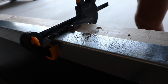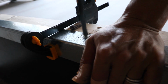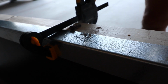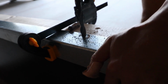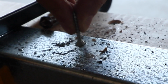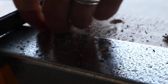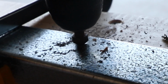And then I've been using this piece just to make it wide. Oh no, flat battery. Okay, give me a sec. Alright, found my spare battery, but I don't think it's gonna last very long. It's only got a half charge. Whoa, my ears. See if the screw has about half a millimeter around it. That means it's wide enough. And I switch over to the countersink bit, and it just makes it a bit deeper.